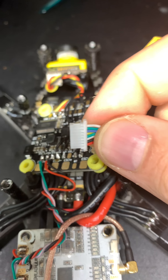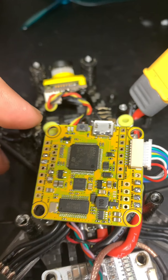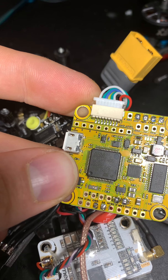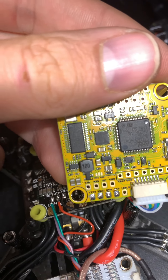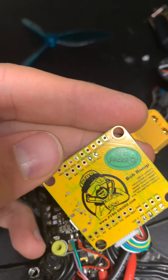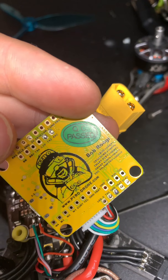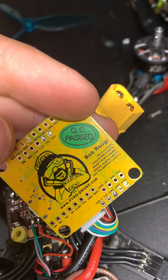The only thing I did here was solder - basically just the crossfire, and then the VTX. You can see I was not using anything else from the other side; it's only the TX2, RX2, TX5, ground, and the VTX.